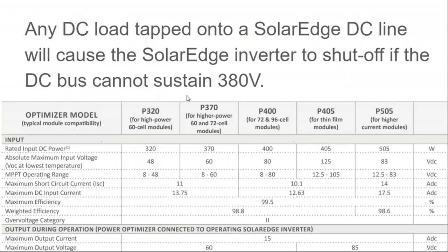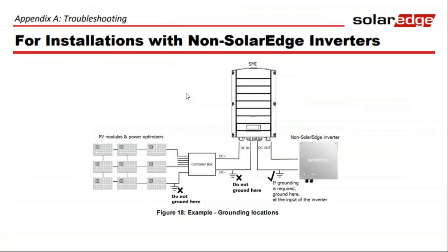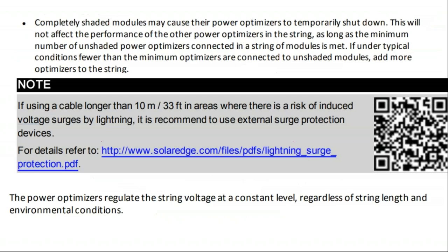And we're trying to talk about what's possible, not what is necessarily allowable. We're trying to talk about the design decisions between when the manufacturer says something won't work, but they won't give you a reason why, versus what the true technical capabilities are of this. And SolarEdge is saying, okay, well, not a generator, but if you are AC coupling us with a battery inverter, this is how we want you to do it. Make sure you're using frequency shifting to turn it off.